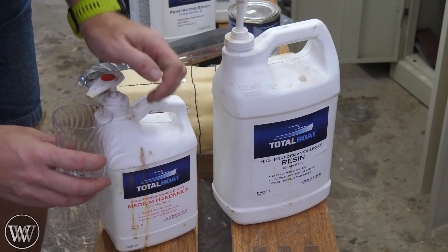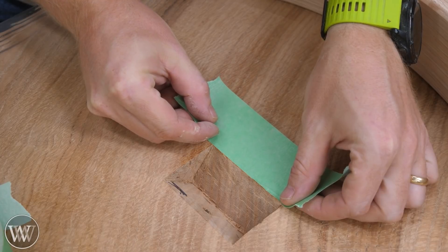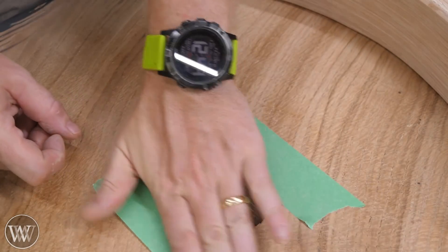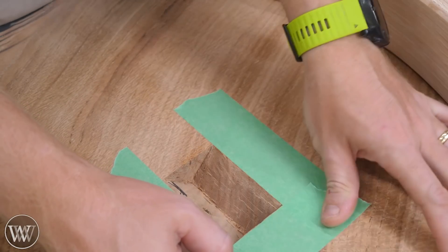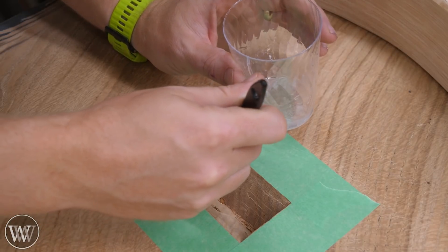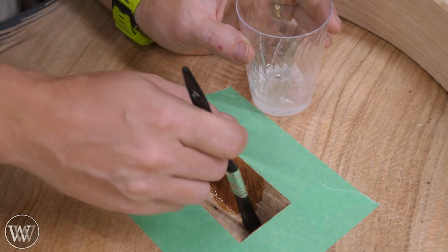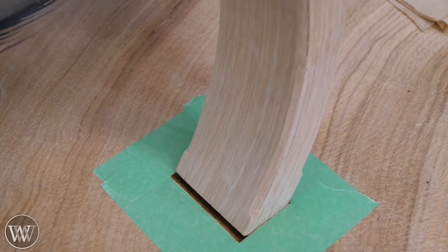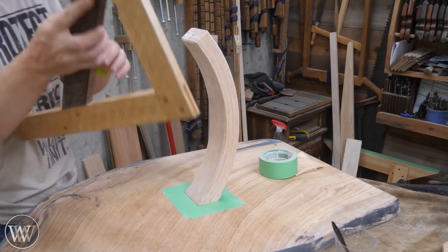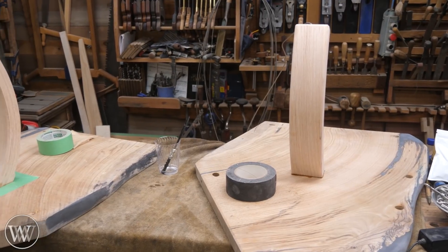Before we do that, we need to actually start attaching the arches to the slabs. I'm attaching the arches before I do any finishing because I have to do some more work around things — I can't put finish on until the very end. So let's actually glue in the arches. On one of these I tried taping it off to keep epoxy from getting under the wood but in the end it just wasn't worth it — I wouldn't tape it in the future. I'm going to put copious amounts of epoxy on all surfaces, fit it down in, first time without epoxy to check contact on all surfaces, then add epoxy where needed. We check that it is square in both directions and let it sit — epoxy doesn't need serious clamping pressure.